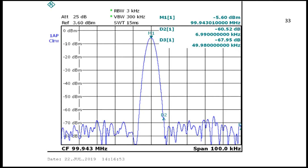Conclusions: I learned that cheap HF seems to work okay, and MOSFETs are hard to kill. MMICs — monolithic microwave ICs — are versatile and have been around a long time. They're 50 ohms — no matter what the frequency is, they seem to be 50 ohm input, 50 ohms out. That's cool. I'd probably use a commercial LO next time. How much quieter are commercial LOs for crying out loud? I see them on eBay — here's a good LO — but what are the specs? Yours is at least 70 dB down from the signal. That's pretty quiet.